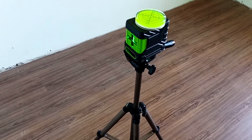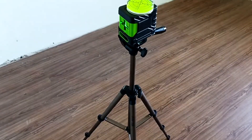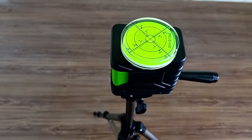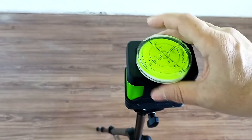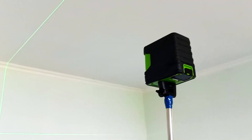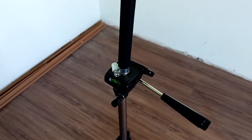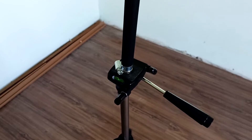Let's move on to practical tests. I mounted the laser level on a tripod — this is a regular camera tripod. For the initial adjustment of the device, I used a round level, which can be removed. Here we have two crossed lines, vertical and horizontal. If we need the lines to be higher, we can use a selfie stick. So I put a laser level on a selfie stick — as you can see, it is almost under the ceiling. I modernized the selfie stick a little; I left a link in the description about what I did.